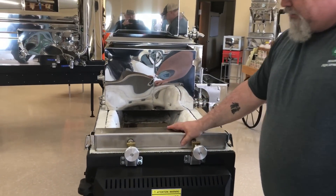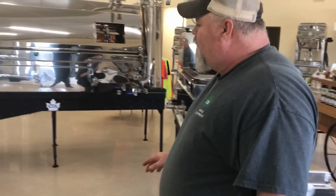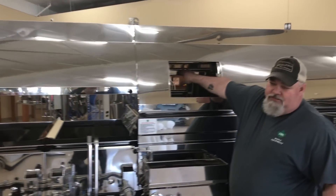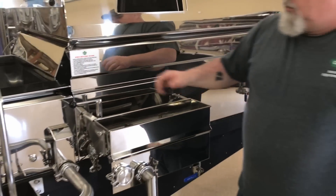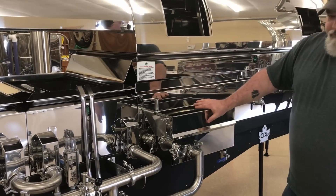This here is a pan tensioner — compare this pan tensioner to anybody else's, it's the top-of-the-line. Over on the three by twelve we have hoods, which you can also get for the smaller ones. Our preheater is stainless steel on the inside. After this year, anybody licensed will need to have stainless preheaters — no more copper. Copper has to be out of your system to eliminate any chance of lead. We have a butterfly valve between the float box and the pan.